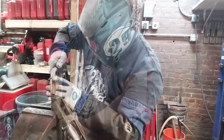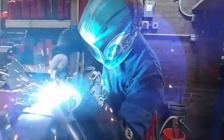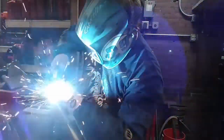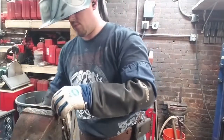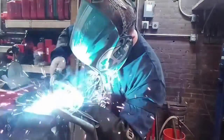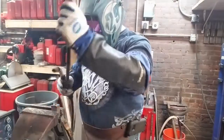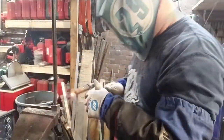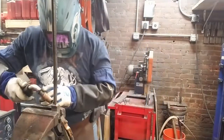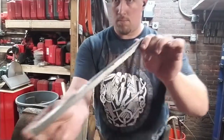It may be very high carbon steel, overly high carbon, or it might be medium carbon and not as much carbon as we need. Now, honestly, from the spark test, I think we have some really good stuff. But regardless, either way, the material of the file will be a moderating influence and should probably improve it one way or the other. So we're making a simple little billet here, and as soon as we get it all welded up, we'll toss it in the forge.